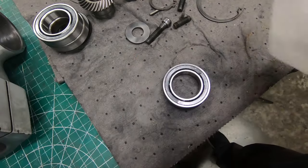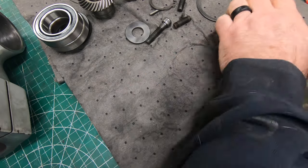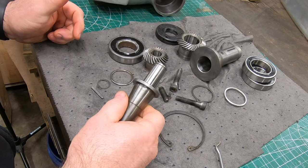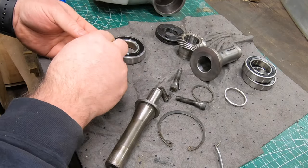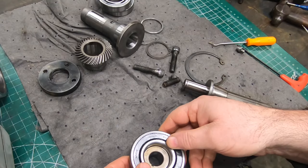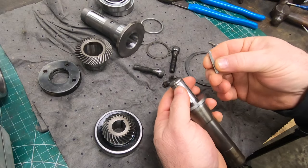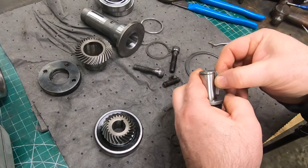These are all clean and ready to go back into the milling attachment. I'll get the input shaft reassembled - there's a big washer/spacer that goes on the R8 spindle first, then the spacer goes on the bevel gear before the bearing presses on. There's a keyway on the input shaft and a small key that needs to be seated, and that will mate with the bevel gear.